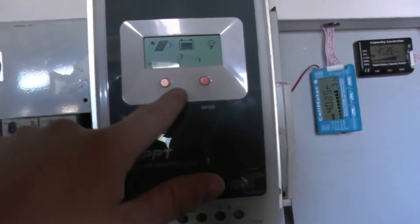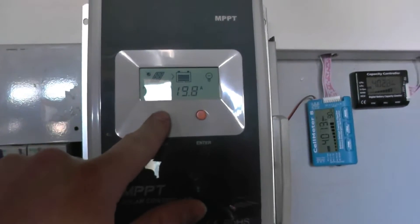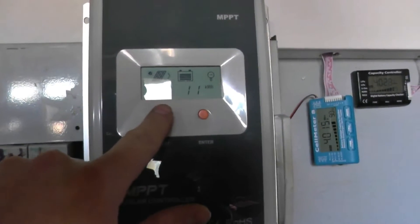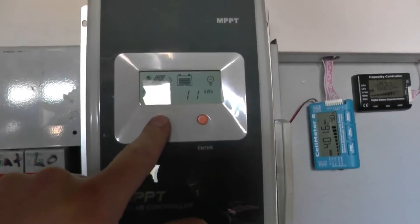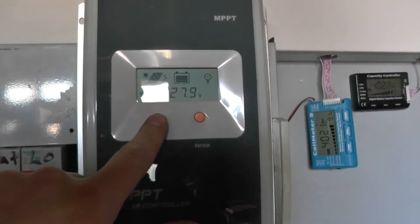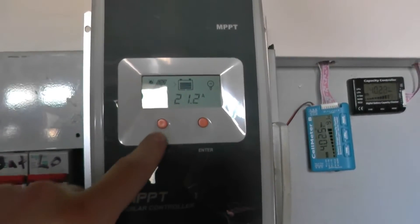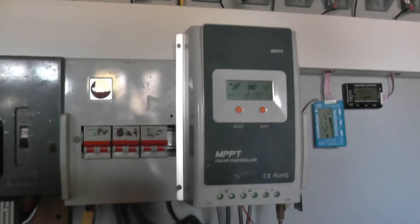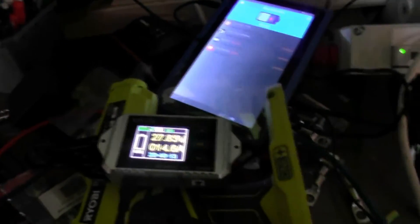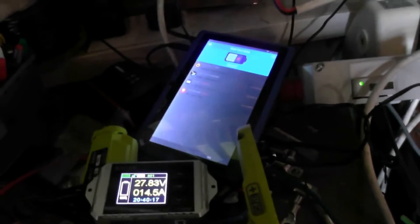Batteries are almost charged. 31 volts, about 20 volts of solar, 20 amps of solar. We've had 11 kilowatt-hours of solar since the beginning of the month. Batteries at 28 volts, 22 amps going into batteries. I've only set it up to 24 volts — so two 12-volt panels in series, and then the big 300-watt panels all in parallel.